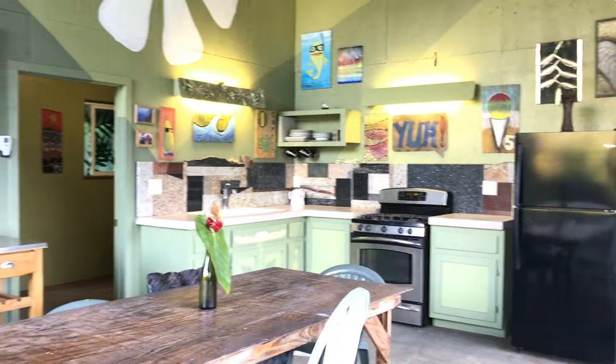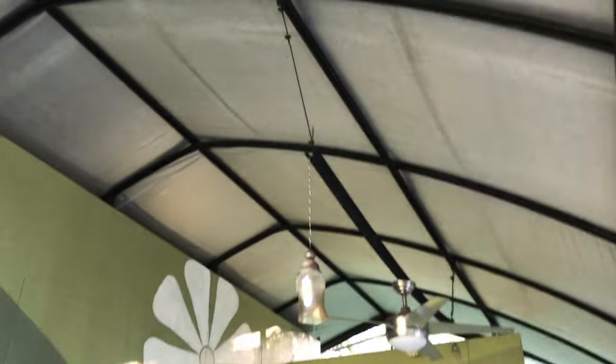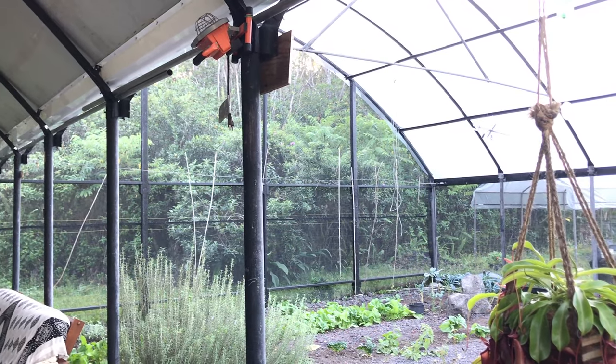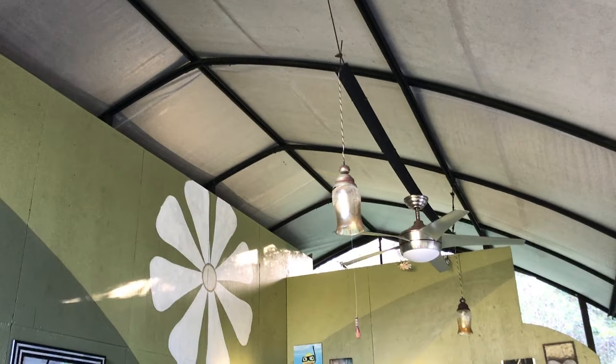One of the first things to consider if you ever want to live in a greenhouse is the roof. If you use a regular greenhouse roof, you're going to get way too hot. This roof is black and white — it's called Dura Scrim, with a nylon reinforcement similar to ripstop. You face the white side towards the sun so it doesn't absorb heat, and the black faces down so you don't get light transmission. I also added another layer underneath from leftover materials, which keeps it cool, shady, and comfortable for living. It also has a six to ten year lifespan, which gives you peace of mind.